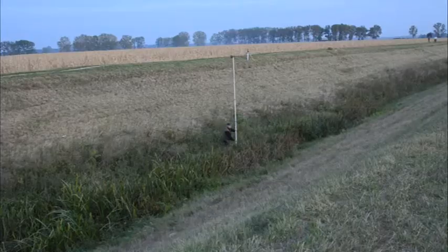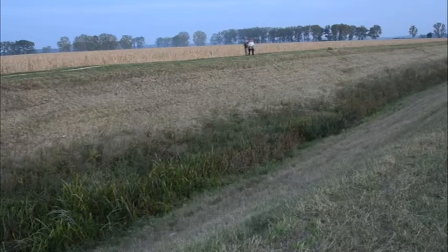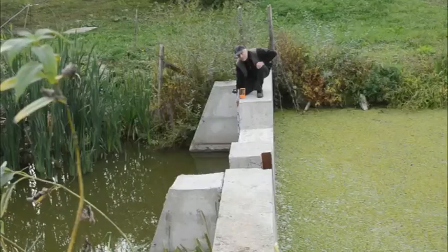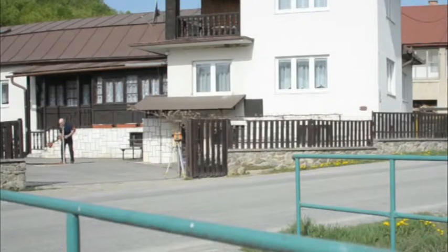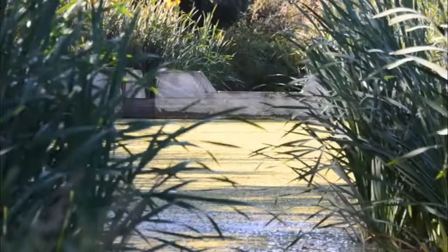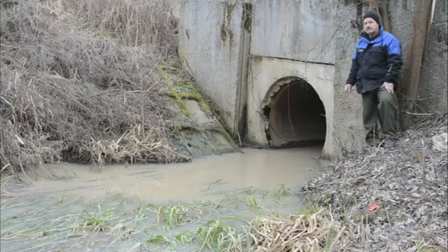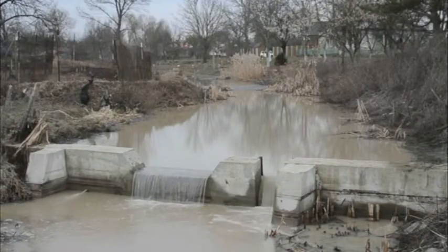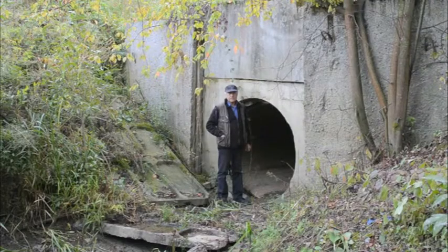While the canal is empty, the water level in the well 70 meters away is 24 centimeters higher. The dried up canal gradually drains the water from the well until both water levels even out. I took a number of measurements in different places. All of them proved that there was a correlation between the water level in canals, wells and groundwater. Wherever the canals were regulated well and managed to retain water, the wells nearby were not short on water. Their water levels seemed stable. However, canals without water are detrimental to the groundwater system because they slowly drain it.